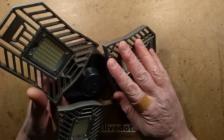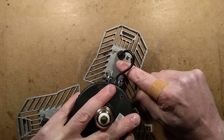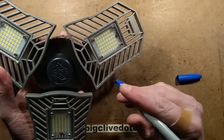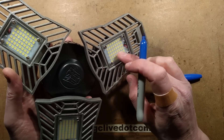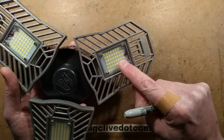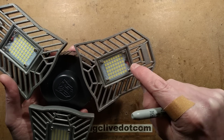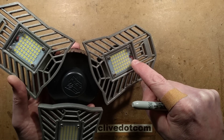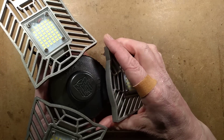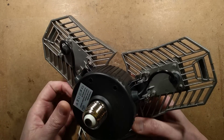After making this video I'll take a thermal image and in the description below I'll tell you what temperature the areas of the unit got up to — the centre on the back, and the surrounding area. I'm also noticing there's a little trench around here that might be for a seal — have they tried to make this waterproof? It's got ventilation holes in the front on both ends, which is good, allowing a bit of air to circulate. Most of the heat will be dissipated from the back. There are also ventilation holes for the driver area, but none at the top — it seems to close quite tightly. I'll also check how hot the circuitry inside gets.